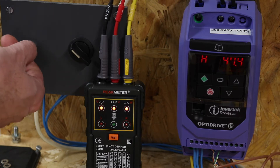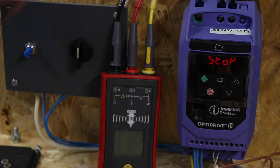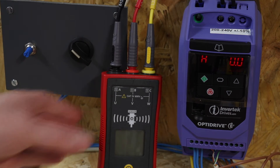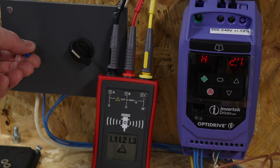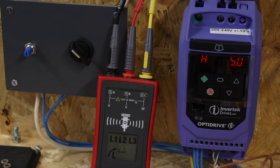Winding down and switching to the Amp Probe. Switched on at zero, we've got two phases present. Going up to 5 Hz again, we have phase presence there. At low frequency it's giving a left rotation reading, though it's not stable yet.